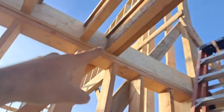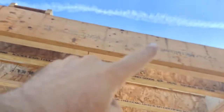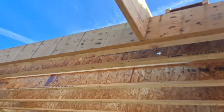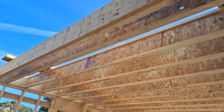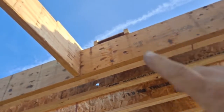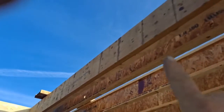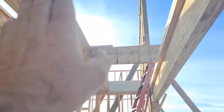Right here you can see the ledger is built to support the joists, and they do have these rim joists. This is a micro-lam two-by-twelve — roughly two-by-twelve — I think it's the exact same size as the TGIs, 11.88 by 1.88. This is different though because it gives a little more rigidity on the sides. That's in the plans, and it's an expensive board. There are a few of them, one on each end, and some that tie everything together.